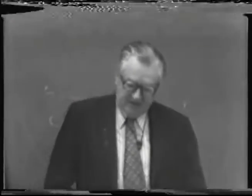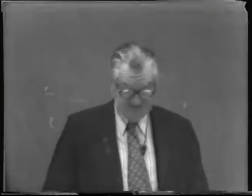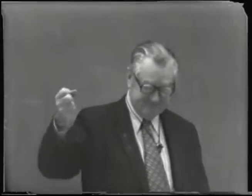At least this manual said 128, 130 degrees. This converts some of the sugars to lactic acid, and then this is sterilized to kill the bacteria, and then cooled down, and then inoculated with yeast, usually with a flask culture built up in the laboratory, and then probably two stages of tanks in the plant. There'll be a flask in the laboratory put into a small tank in the plant, and then that'll be transferred into a larger tank called a seed tank, let's say, in the plant, and that'll finally go into the fermenter.